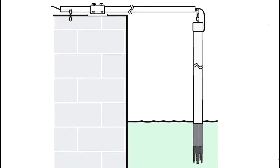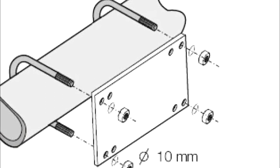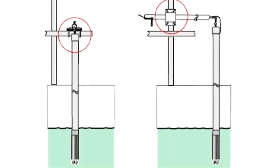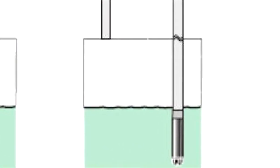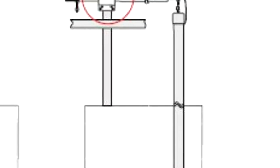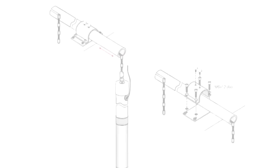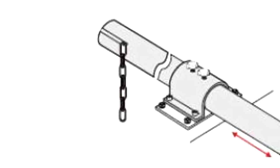These are used when the probe has to be extended into the tank or at a depth from the top of your handrail of more than 2m. They can be fixed to the vertical or horizontal poles of a handrail via a fixing plate and U-bolt assembly, or fixed to the coping at the side of the lane via a fixing plate. The chain travels through the horizontal pipe and attaches to the vertical pole holding the LDO probe. The probe is again screwed into the bottom of the pole and its cable travels up inside the pole and emerges out of the top through a gasket below a threaded end cap. The chain can be tied off via a slot in the horizontal fixed pipe, allowing the customer to set the overall depth of the LDO probe.